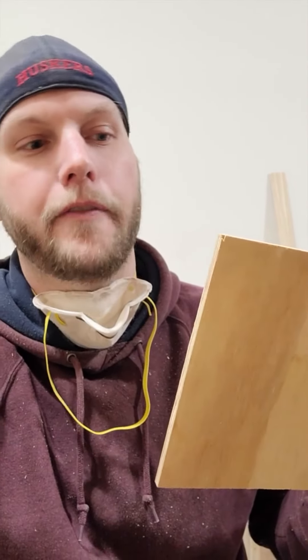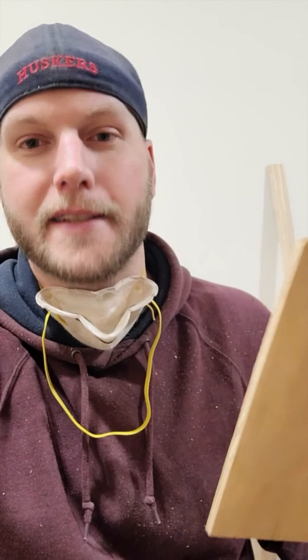Let's round up and call this off by a 16th of an inch on a seven-inch by seven-inch square. Well, if this is off by a 16th of an inch, it's not actually off a 16th of an inch for every seven-inch cut I make — it's off a 16th of an inch for every seven times five, so 35 inches of cut. So over seven inches I have a fifth of that error. A fifth of a 16th is an 80th, so over the course of seven inches I am off 90 degrees by about an 80th of an inch. And given that the cuts I'm making are smaller than seven inches, I'm off by even less than that.